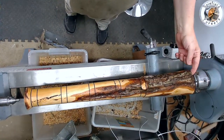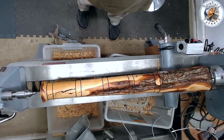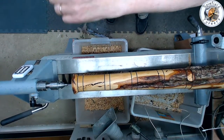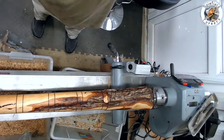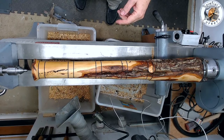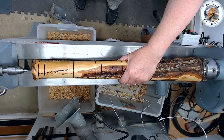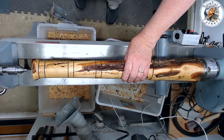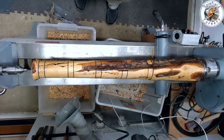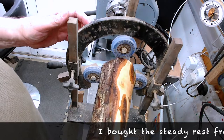I've mounted this now on the 50mm chuck. To get this to fit without putting the extension bed on I've had to move the headstock and tailstock all the way over to the end of travel. To drill this I need to put the steady on it — it's too long and might wave around — so I'm going to take this off and put the three-wheel steady bar on.